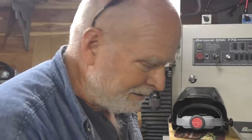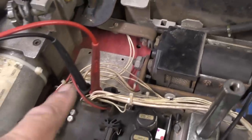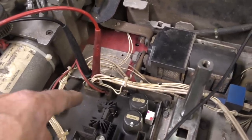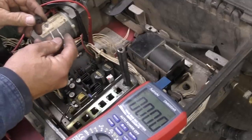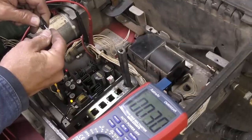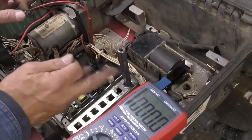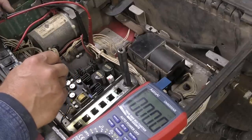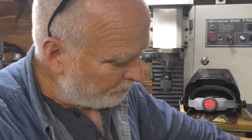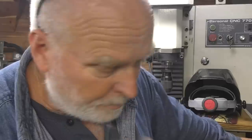I need to see what voltage is going to that contactor. I've traced the wires from the contactor back to the control board and put the probes in so I can measure the voltage coming off the control board. If it drops out, we know it's the control board and not the wiring. We know the voltage drops out from the control board — so the control board is shutting down the contactor. The question is why, because the welder's not shutting the power down — the motor keeps turning. The motor and the contactor use the same power source, coming through the welding cable.